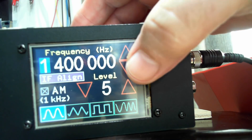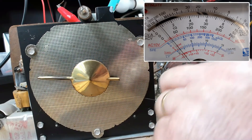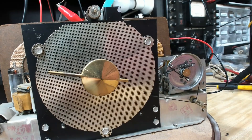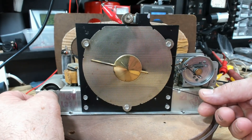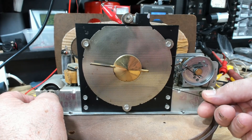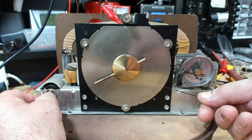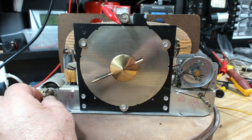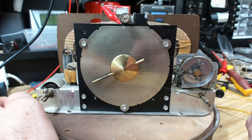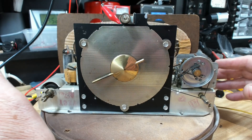Just for luck, I'll put this at 600 and see if it lines up. I'll wind it around to 600 - and there it is, that's pretty close to 600. So that's a good alignment. Now the first station is 612 - I'll just tune to that. Well, that's working through the shop speaker now so it's got a lot more bass. I'll connect the original speaker up. It's working really well now - I'm very happy with the way it's going. So I'll clear all this equipment off, do the case, and it's ready to put back together.